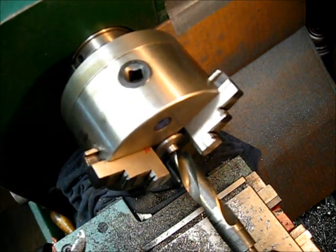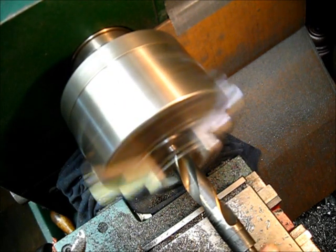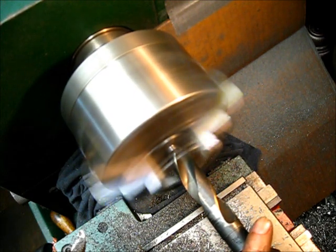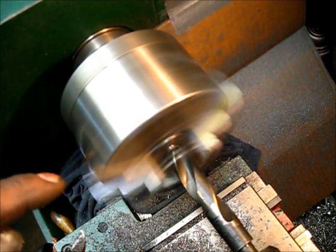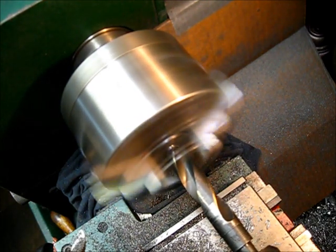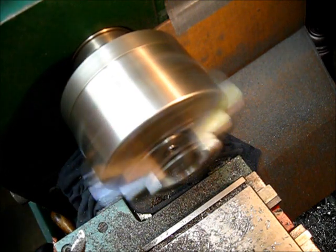Okie dokie, you see that? Put that up there like that, turn that over like that right there, and we're going to mill away the lip as we end up with a countersink in there too. I can see down in there — I only wanted about a sixteenth of an inch, which is about what that is.